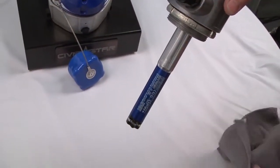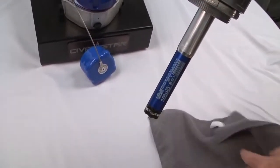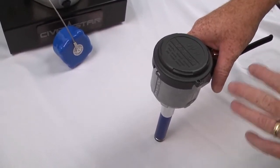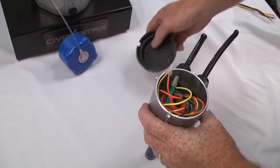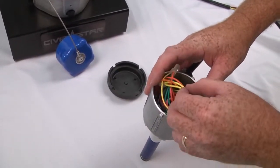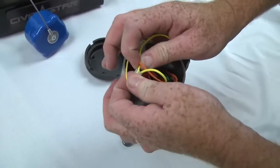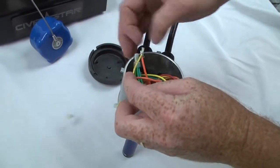The first step is to ensure that the probe is dry on the end of the prism. Just take a dry, clean rag, wipe it off, and see if that clears out your faults at your tester. Now if you've determined that the probe is essentially dry and it's still showing a fault state, you'll need to start inspecting your wire connections. Start by removing the housing cap on the problematic probe. Be sure to check all crimp connections for being properly crimped and free from corrosion. Give each connection a pull test to make sure they're crimped properly — like that one right there that was easily removed.